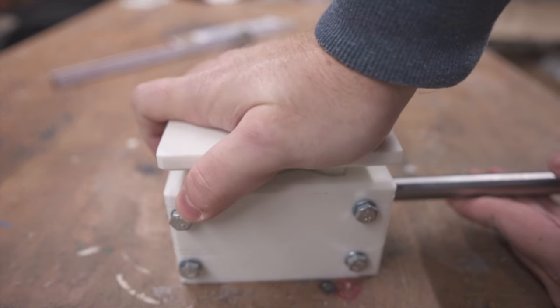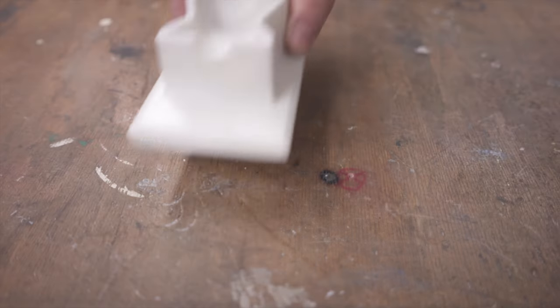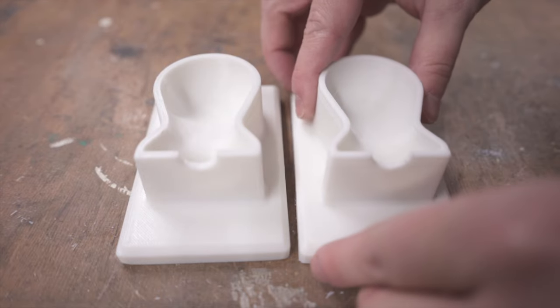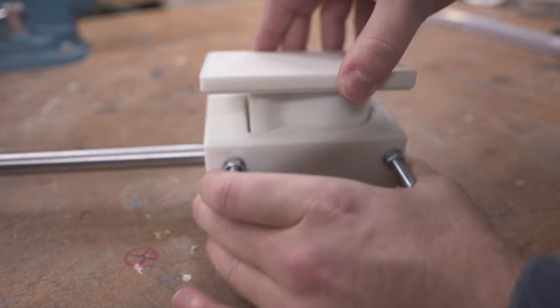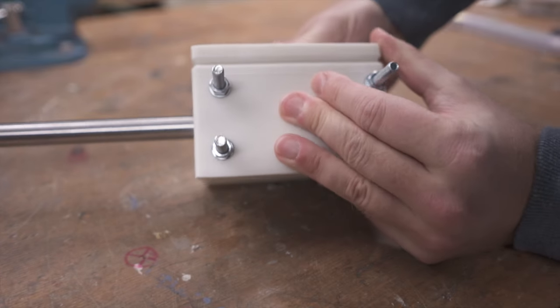Turned out that the prints without any clearance in between them were too tight of a fit, so I went ahead and printed a second top part with 0.5mm clearance. That fit in almost too easy. The next time I'll be reducing the clearance again a tiny bit. The model I uploaded has already all improvements built in, by the way.